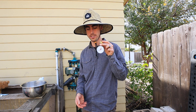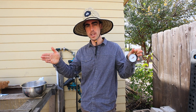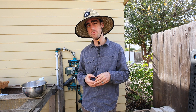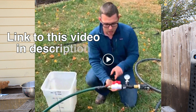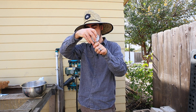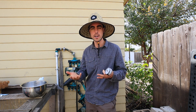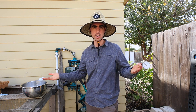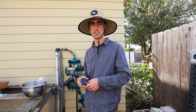The best way to measure and build one of these would be to build your own little testing rig. Michael Kilpatrick did an awesome Facebook video that I'm going to try to find the link for and I'll put it in the description. It just goes: hose, PVC valve, this pressure regulator on top, and then a connector to connect into whatever you need to measure — whether it's a hose or half inch or one inch, whatever it may be.